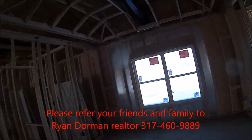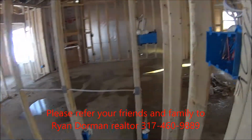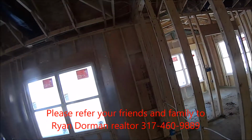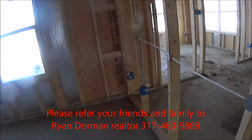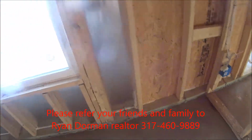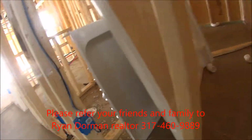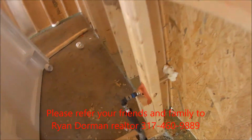You will have 3 switches in here. 2 of them are for your ceiling fan pre-wire. 1 is for your half-hot, which is that outlet over there. And then you've got a TV and phone hookup over here on this wall. And then that there is your other hose bib there on the back side of your home.